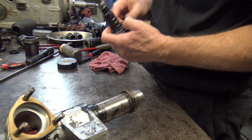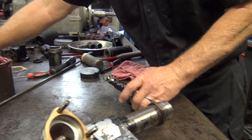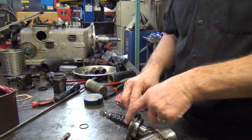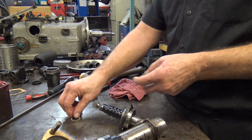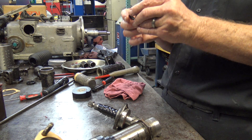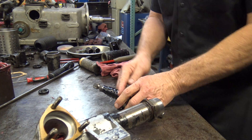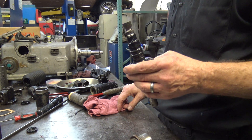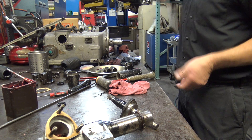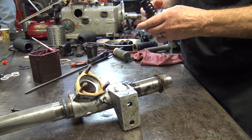When I change to new rings, what I do — and it's tricky — is pull that inner spring out of the seal. On a new seal you can get that out pretty easy, so there's less tension and it slips over easy, because sometimes those rings are not out far enough. But don't forget to put the ring back in. The most common thing I've seen guys do — and I'm guilty of it too — is to leave that oil ring out. You start it up and it works great, it growls, you add more fluid, and then all of a sudden things start getting bad. That's the experience part — I've learned.